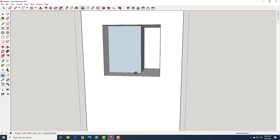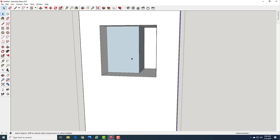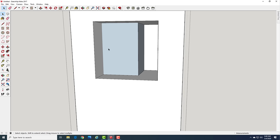You see, we should be able to clearly see through this mortise and out the other one because they both kind of overlap each other just a little bit. And I'm going to show you how we fix that. There isn't a line here, it doesn't really exist because this got pushed in. And the same thing over here, the line here doesn't really exist because that got pushed in. So I'm just going to draw those two lines and then we're going to delete this stuff and it'll make sense. I know this seems awkward, but you'll get used to it as you do mortises.